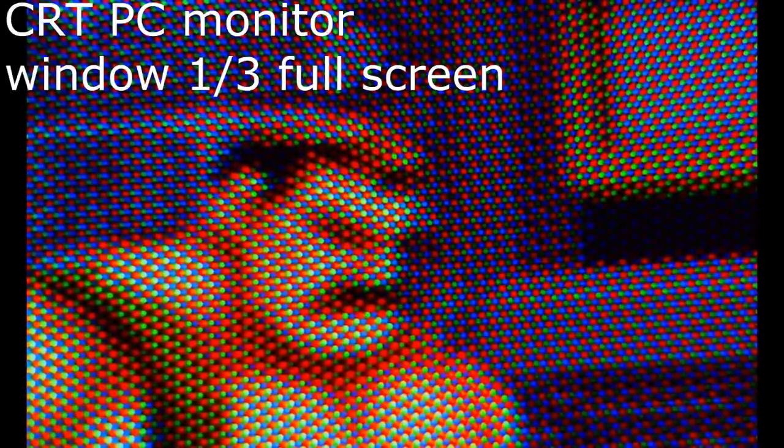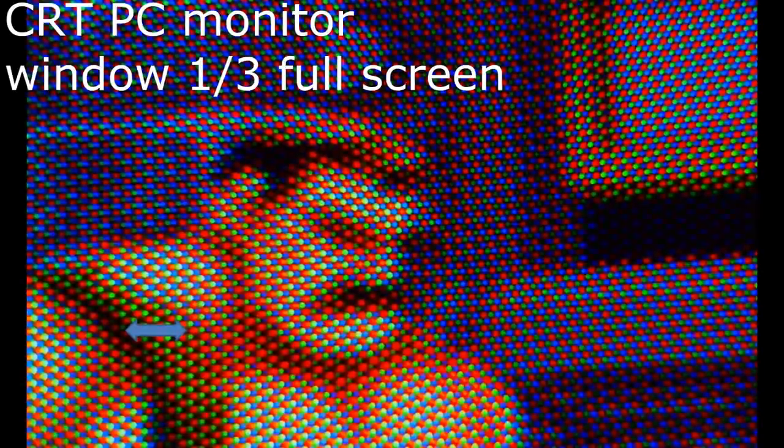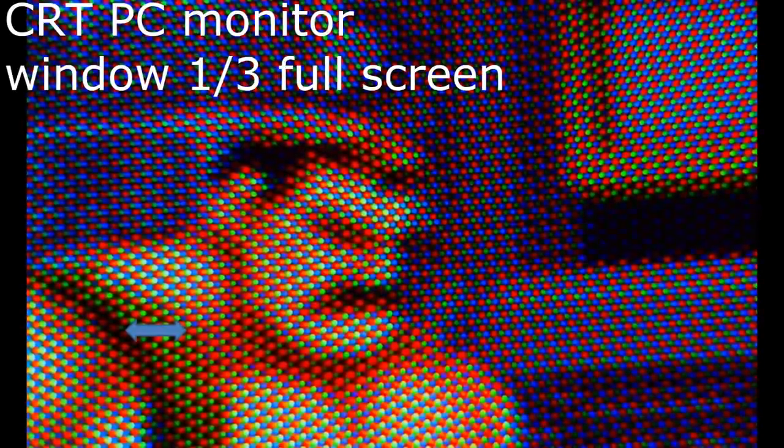The brace is displayed on about 4 or 5 phosphors, and the overlapping effect, as we have seen previously, happens on about 1 or 2 phosphors. So what is important is this ratio, 5/2 or 5/1, which in the end is not too big. And this must be the case for any element of the image, for example, the eye, the hair, the moustache. The ratio between the number of phosphors and the overlapping effect must not be too big, so that the features are smoothened by this overlapping effect. And we can see that the brace is smoothened.